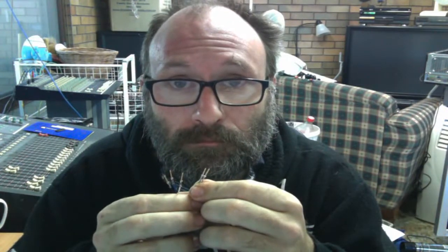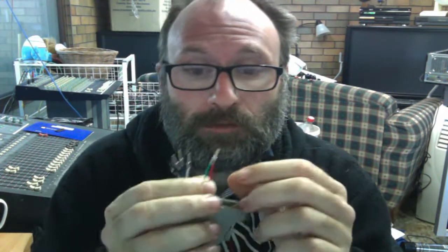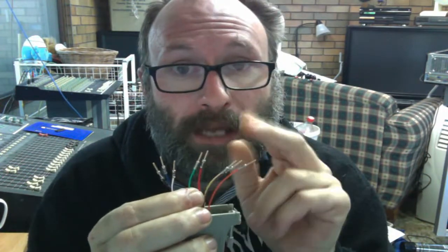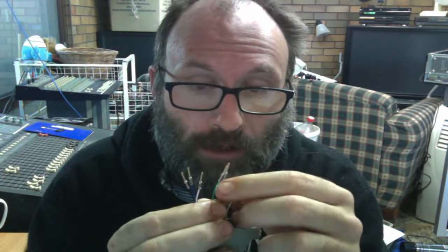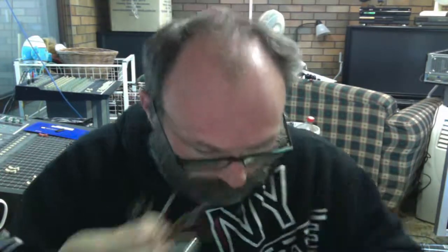Primarily you have pins 4 and 5, so it's not going to matter which one of these pins you butcher — you can use either of them really. What we're going to do is pick one at random, cut it off, wrap it as tight as we can around the leg or bottom of the other pin, and then put it together in the slot for pin 7. When you buy these, this is how they come. I've got 3 of them, which will make life easy so I don't have to walk around the back of the cabinet every time I want to switch between serial on the Sun server and the e-server.